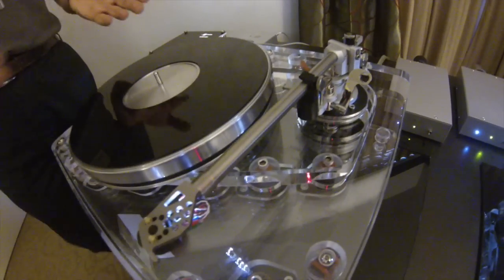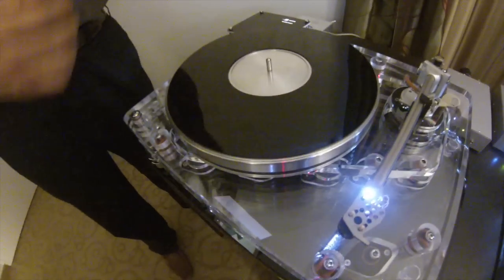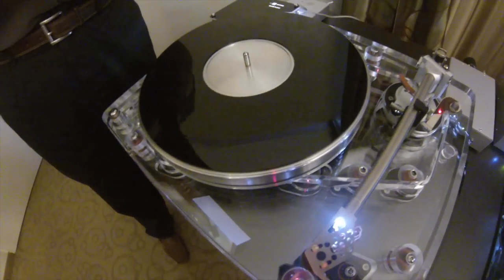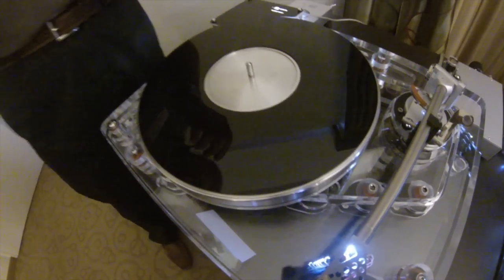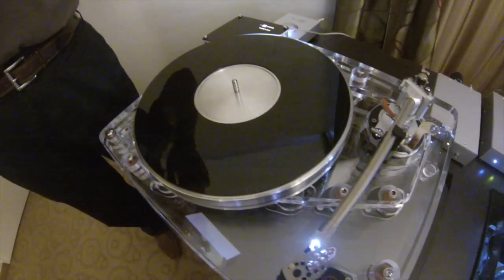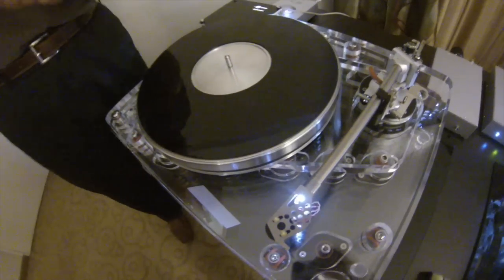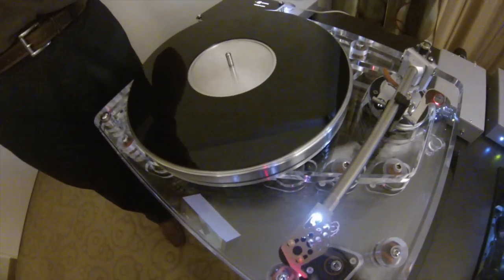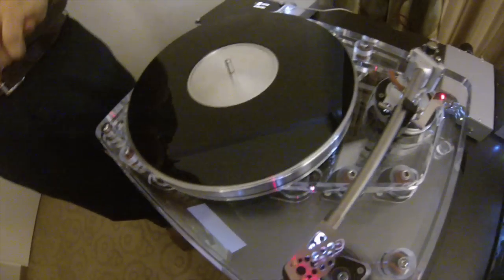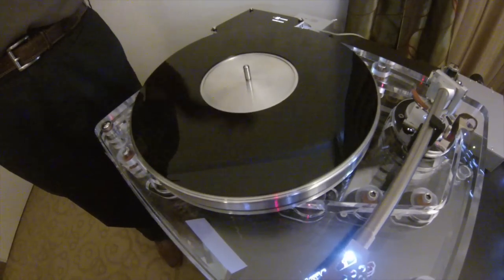The bearing housing, unfortunately, I don't have one to show you. It's unbelievable. This one uses a tungsten carbide spindle and aerospace grade phosphor bronze. The gap between the 2 is 2/10,000ths of an inch. So the oil, we formulated the oil in England with one of the oil guys, very good. We added anti-friction, anti-foaming, because as it's spinning sometimes you get foam bubbles. It's anti-foaming, water repellent, so even in high humidity places the water actually comes out of the oil. And it's got a coolant accelerator. So the tip, which is the only place that is contacted, gets rid of the heat quite rapidly.